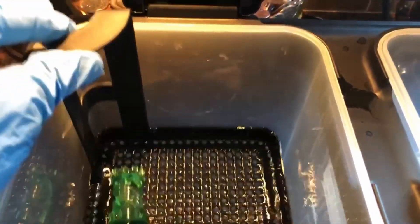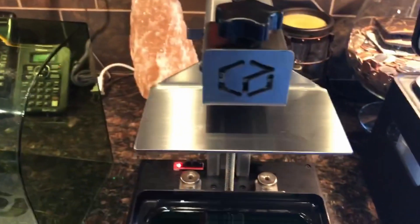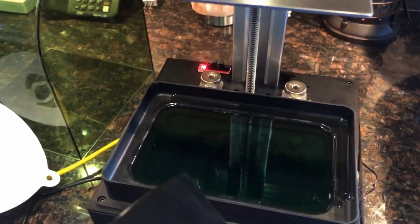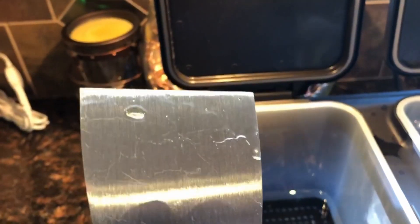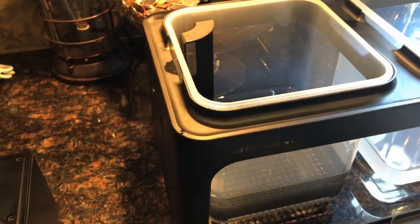I successfully got the rook off the build plate and into the first rinse tank — doing this by hand, gloves on. When I got the cover off there was a lot of resin film, so I used the black squeegee that came with the printer and scraped it back in. I had a little drip, kept isopropyl alcohol and rags nearby. The rook has a base plate on it, so I cleaned that off, swished it around, and used flush cutters to break off the square build plate adhesion layer.